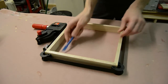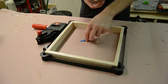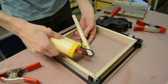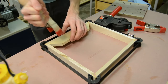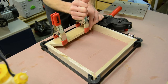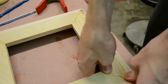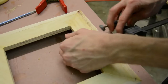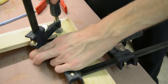Here I'm cleaning the excess glue out of the corners before it dries and becomes harder to remove, and also checking for squareness. When cutting the maple pieces for the outside edges of the frame, I ripped each width to give me the proper reveal for the clock face in combination with the plywood strips I'm now adding around the inside perimeter on the back of the frame. I glued each piece in individually, letting them dry in between, and added a staple to each corner miter of the maple frame for a little added insurance.